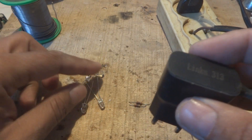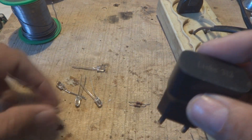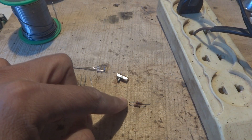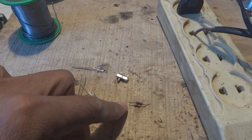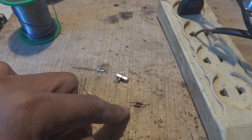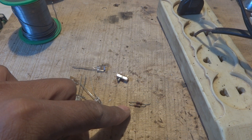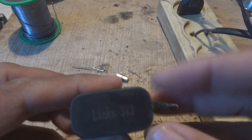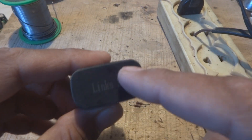The idea is we will take 4 LEDs, one switch, and 2 resistors. You can use even a single resistor of a little higher wattage, but what I have is two 270-ohm resistors. These resistors will be enough for this project.